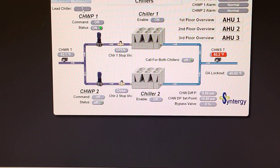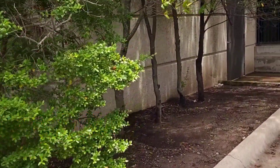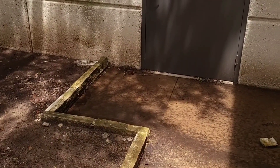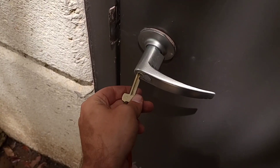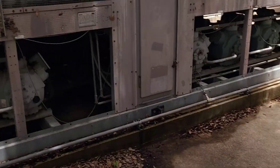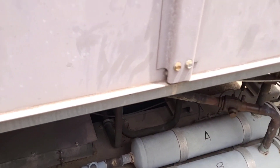I'm talking to you now before I go in there because it's really loud inside that chiller yard. End of the day, one chiller is completely down due to leaks and EXV issues. The other chiller for that building has only one circuit running because there's an EXV issue that won't let the other circuit run. They've literally got half a chiller running an entire building. They're complaining about some alarms — we're going to look and see. As long as that one circuit is online and charge looks okay, there's not much else we can do.